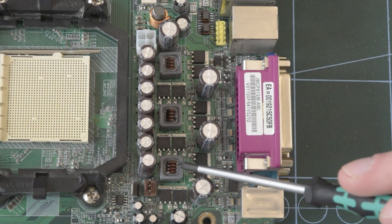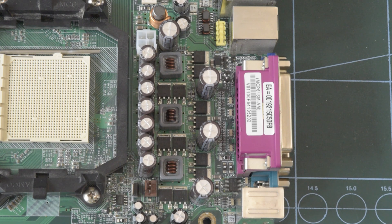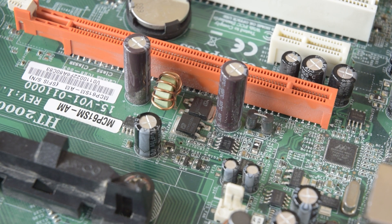Here you can clearly see three identical sub-circuits that have been replicated, and these are often referred to as power phases. Each of these sub-circuits is just a simple buck converter. But what actually is a buck converter? Well, this motherboard helpfully has a few non-multiphase buck converters we can take a look at, like this one over here. So let's take a look at the components making up this single buck converter.